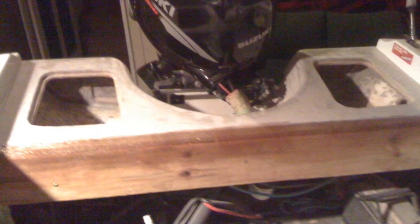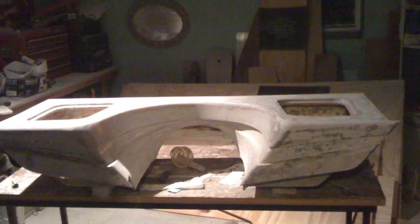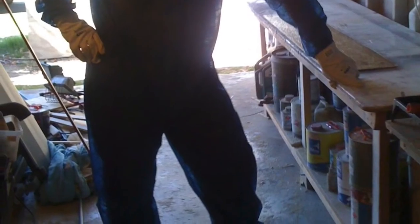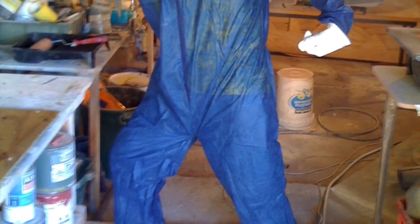That's what the back of the boat looks like without the live bait tank — a lot of wasted space. I fitted the tank by making the basic shape, then taping around the edges, fiberglassing to the tape, cracking it out and grinding it to make it look good. I put fiberglass wires and LEDs into the tank, which actually lasted a very long time and still show well.